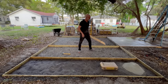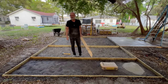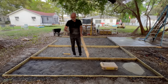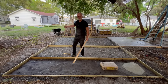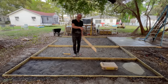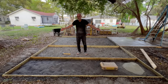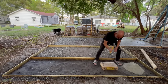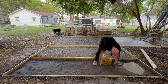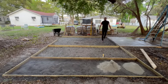Then we're going to take the water hose. We're not going to squirt it. It'll go everywhere. We're going to mist it. And it's going to be done. Then we'll just mist it over and over. The bottom is completely saturated, so water's going to come up. The 2 inches I'm getting ready to put down, I'm going to spray as much water on it as I would have mixing it up in the wheelbarrow. And the other 2 inches is going to get the top coat of water, plus everything underneath. And in theory, this should work. So, all right, let me get to dumping some of these bags and let's have some fun. This shouldn't take too long, right? It's going to take me longer just to dump the bags probably than anything else. So here we go.